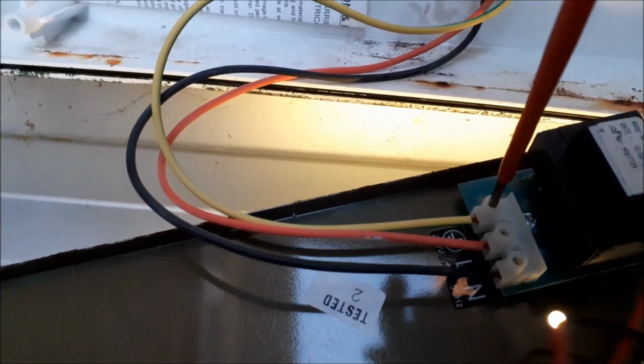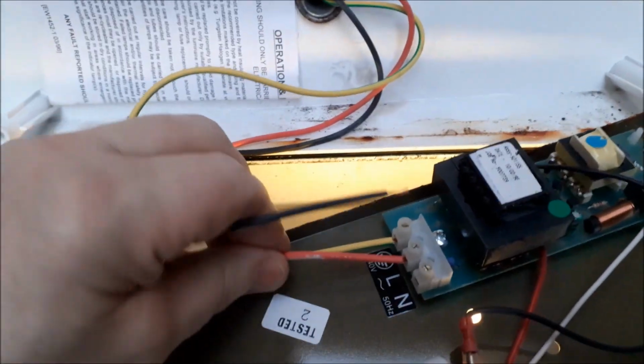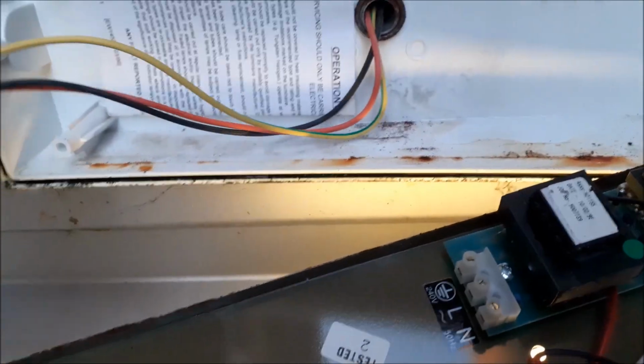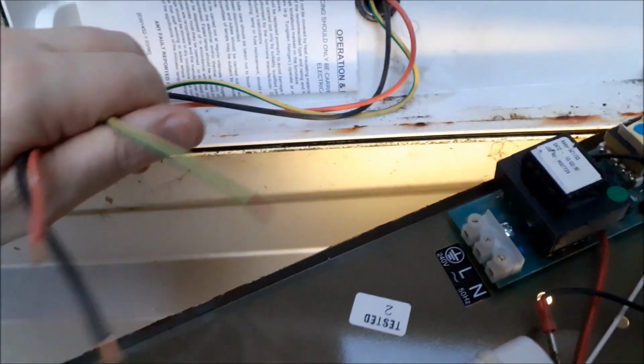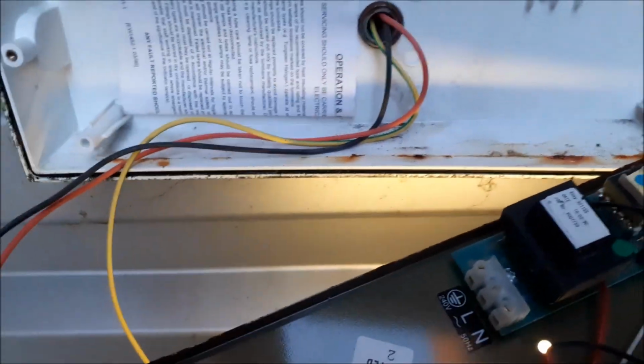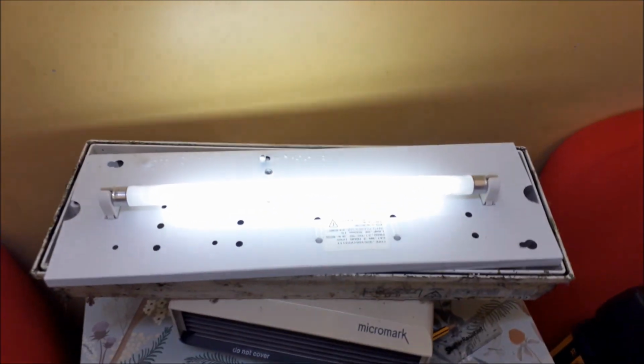You also have the option, if you want to, which I'm doing with some of these because they're out the back where it's quite dark, you can set them to actually stay on all the time, which we're doing around here because we've had some of the big security lights fail. So to say, normally it's only a live, neutral and earth, so very simple to do, not a big job at all. That's the old fitting off the wall.